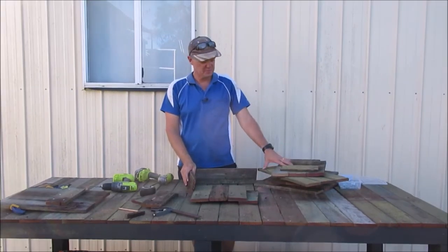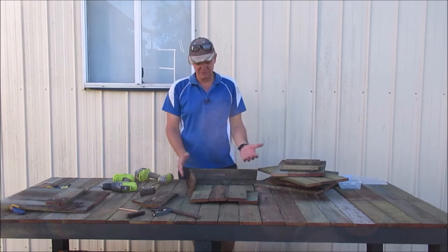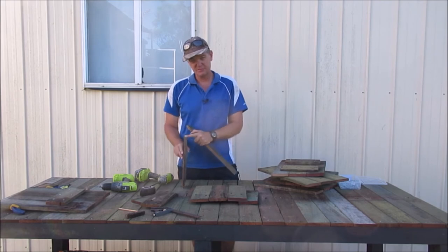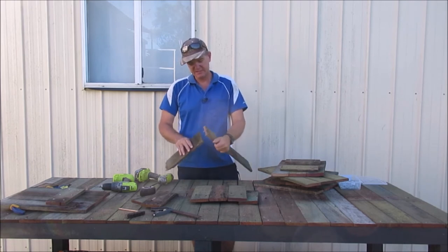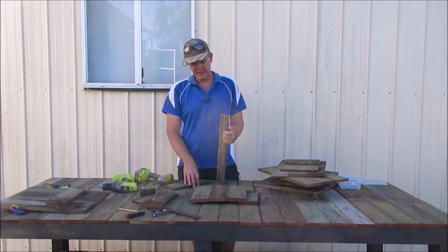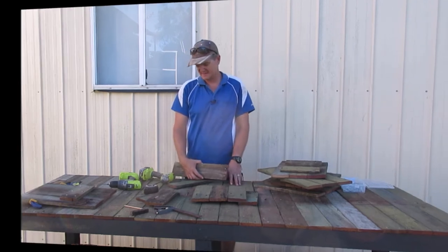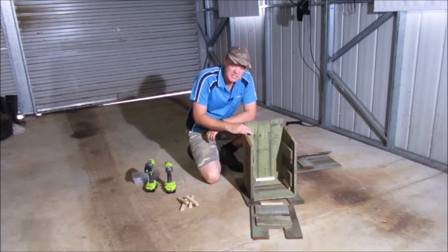I've got all my pieces ready to go — I had it all together just before just testing and checking that everything looked right, which it did. Then I was thinking about how to attach it and did a test run, because I was pretty certain that drilling and screwing into the end grain of hardwood wasn't going to be very strong. I attached a test piece and just gave it a flex, and it split the end straight away — not really surprised. So I need to find some other timber to cut to size and use as attaching points in the corners. It's now raining so we've come inside, but the possum box is set up ready to be put together.